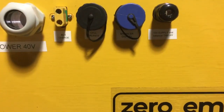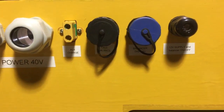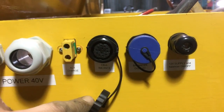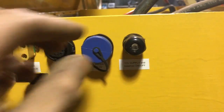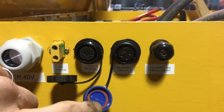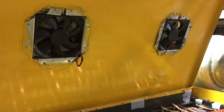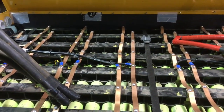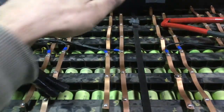The other connections on the outside of the box are a charge port and XT90 for plugging in a balance charger when we want to. This one is a lot of pins — I think it's a 16-pin connector. I needed 13 for the balance charger. The other one is four pins, and that is supplying 12-volt DC to run the cooling fan circuit on a thermostat, and also extending a signal for the on/off signal for the cell balancer that's going to live in here.